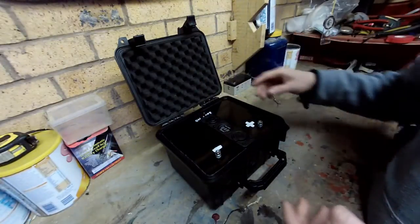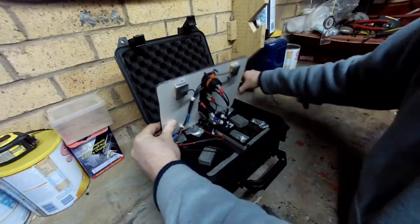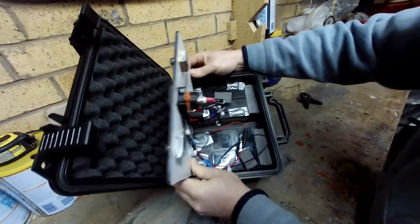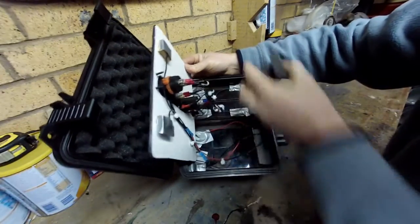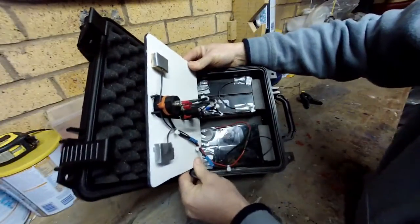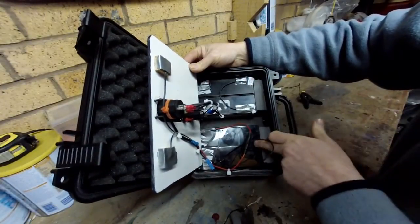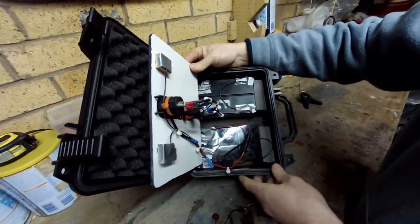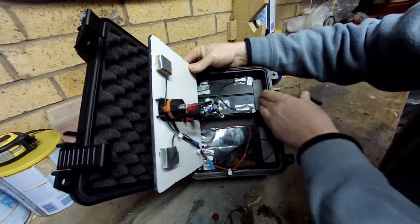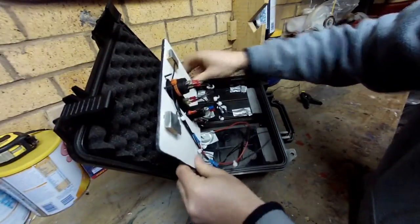Inside, we've put it off. Inside we've got it all foamed up now. The foam is positioned - these are just a couple of wee bit extras just to take some of the pressure from the surface. I've used closed cell foam which is waterproof in itself. Two 12 amp hour, both 12 volts, in parallel, which has given me 24 amp hour, 12 volts - which is a lot of battery power. I've used closed cell foam, just filled it out with that, so the batteries don't move at all - absolutely solid.